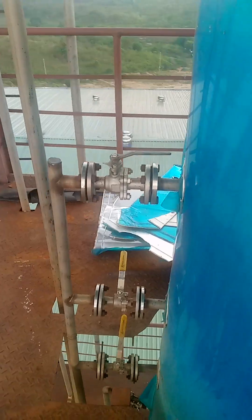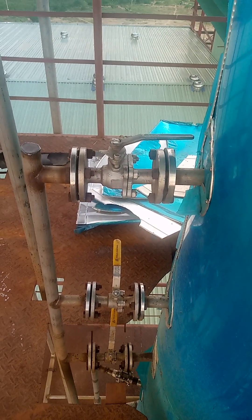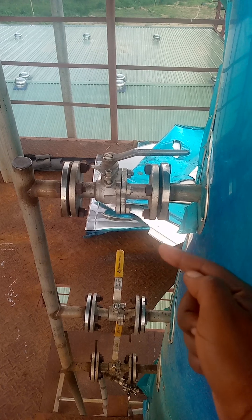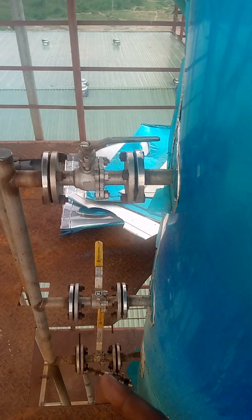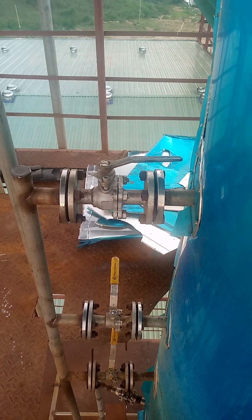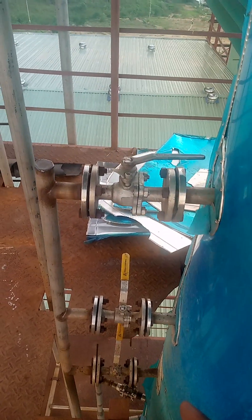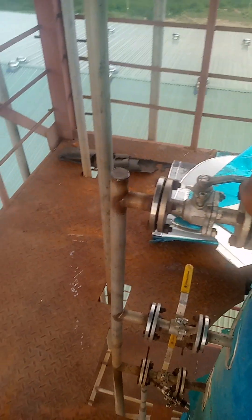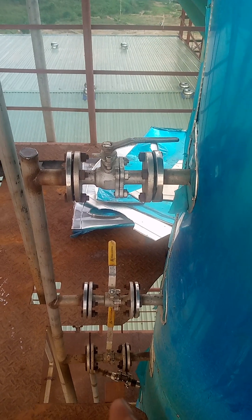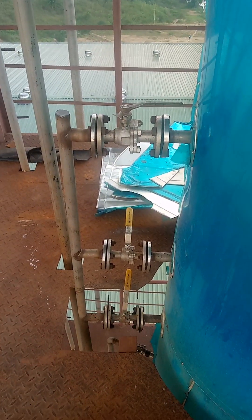Here is where we have our three or four valves to tap off the main product. You open the second one partway and open 50% of this one. The reason is when you open 50% of this valve you have liquid with minimal impurities flowing to main storage. However, there may be an impact on strength, as one valve gives better strength while the other gives better quality spirit. The plant is currently running on manual mode — all this will be rectified once we go automatic.